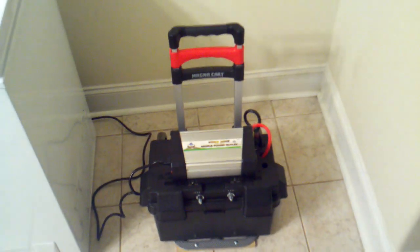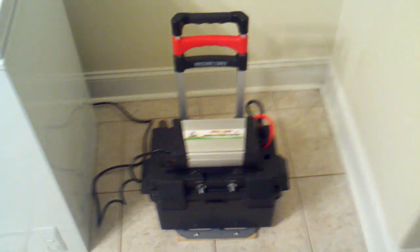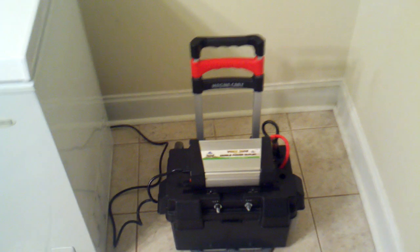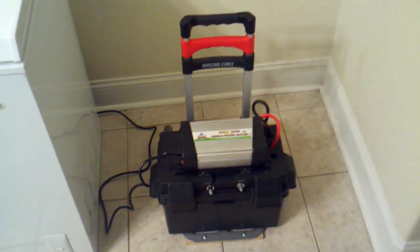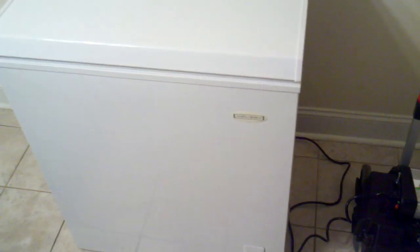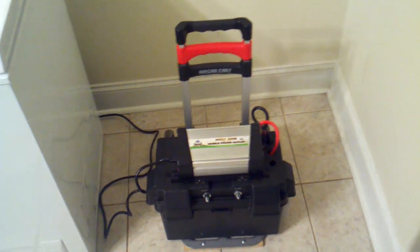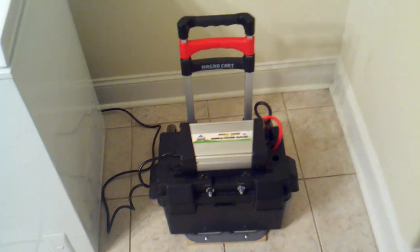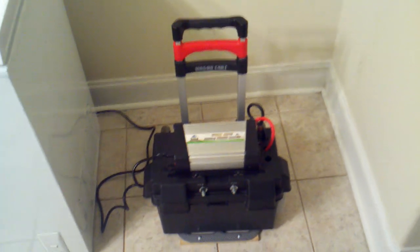The point of all that was to hedge my bets in an emergency situation with a prolonged power outage. If it's raining or cloudy, we have no idea how long until the sun comes out to charge the batteries. The compact freezer is AC, not DC, so I plugged it into the inverter. Prior to this test, I ran it at a very cold setting so everything inside is going to be really deep frozen. If you're running this off a generator during an emergency, I'd recommend turning it to its coldest setting so everything becomes solid blocks of ice.